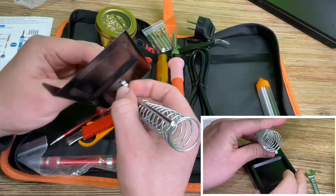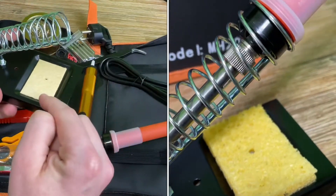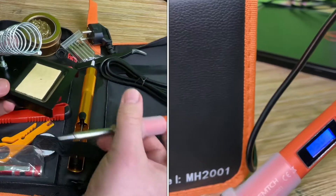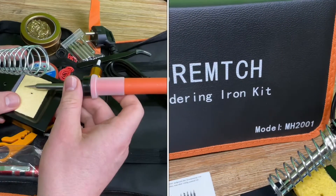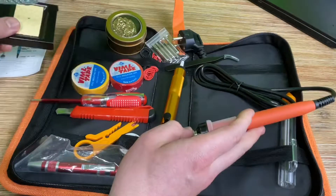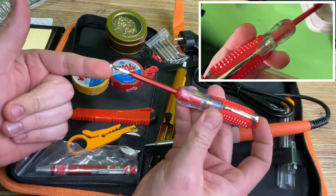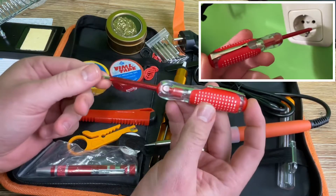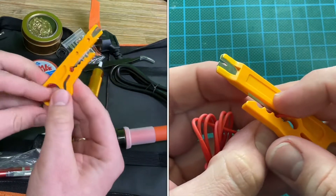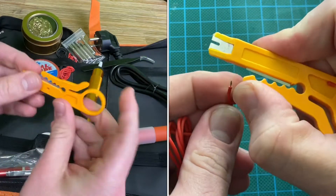It's really easy to replace the tips. Choose the correct type of soldering iron tip and place it on the iron. Turn off the power switch, then rotate the screw nut anti-clockwise. Lift up the ventilation holes cover — the shield — and then lift up the soldering iron tip. Put in the other shaped iron tip on top. Then place the ventilation cover back on top, and lock the screw nut by rotating clockwise. The tips are replaced easily.